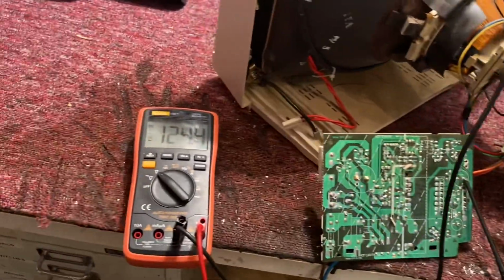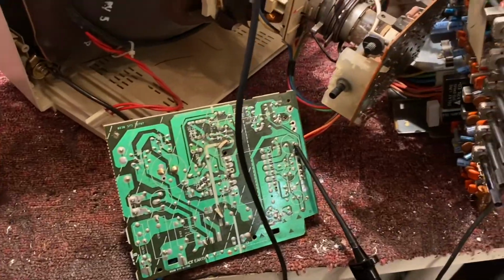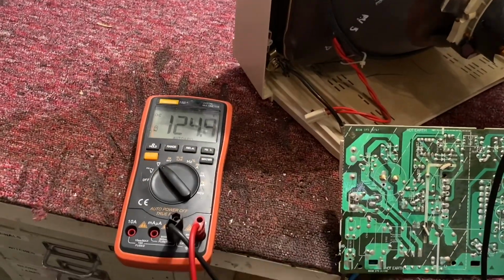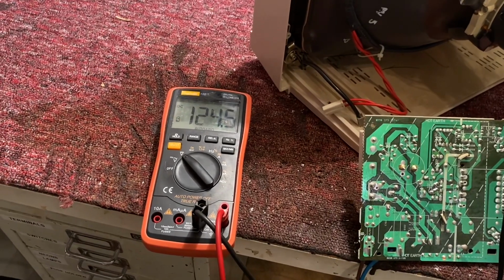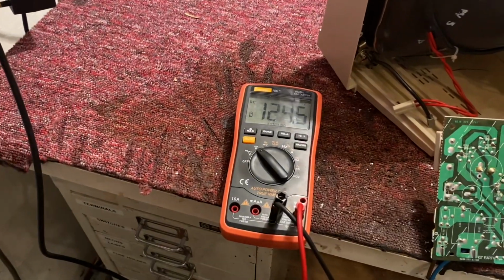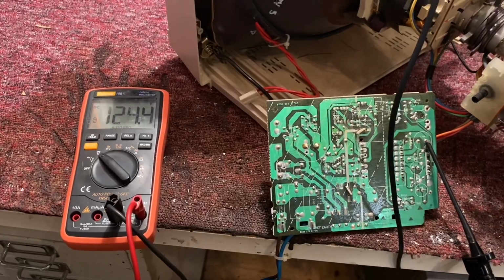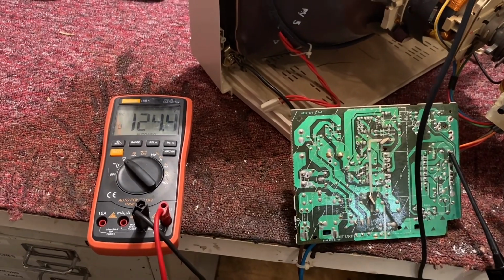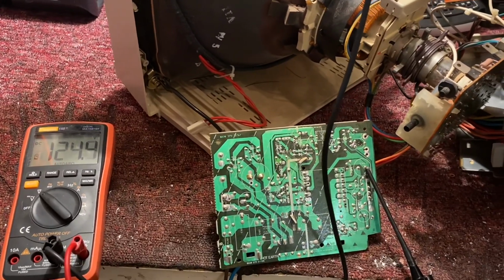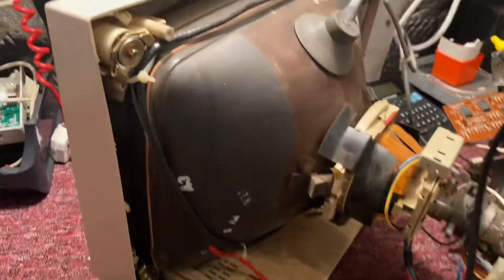Pretty much all you do is you get your decent meter and you adjust the very small screw terminal. All of them are regulated together. So if one voltage is down and it stays low, for example, then you know you have a slight short on that supply, if that makes sense. If all of them are controlled by the same adjustments or presets. Anyway, so now I've sorted that out, let's take a look at the picture then.